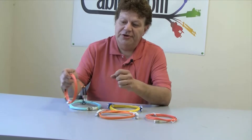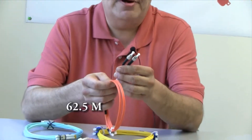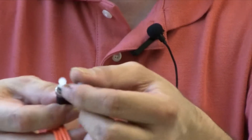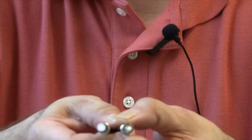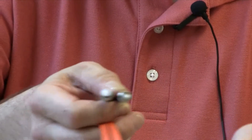The first one here I'd like to show you is orange in color. It is a sixty-two and a half micron size fiber, and this is capable of handling one gigabit in the bandwidth. The type of connector on here is an ST connector. It's a circular connector, and when you plug it into its mate, you give it a half twist. It's a bayonet style, almost like a camera lens, and it locks into its mate.